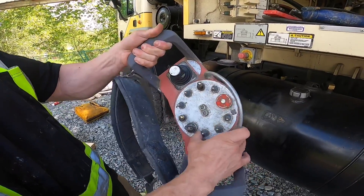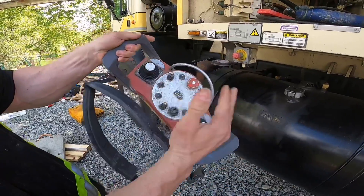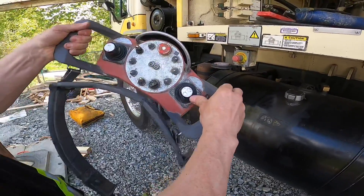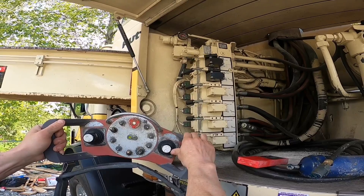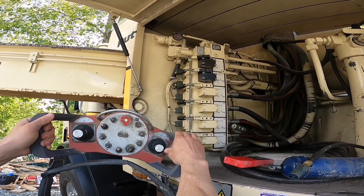It's something I consider the most critical setting. So what I want to do is set the left-right on this — the slewing — because the slewing on this is actually quite touchy. When I lean in, if you look at the valves there, it's going to be this valve here for the slewing. I just touch it and it's not very progressive.